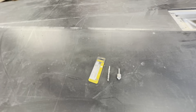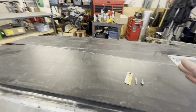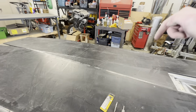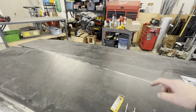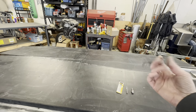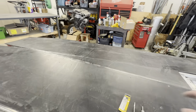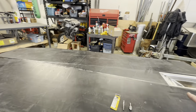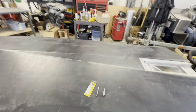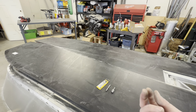Okay, so I've worked on some boats and had to save them. Some guys really don't know what they're doing and they just drill a hole straight through and then just put their bolt through. Then you need two people, one on the other side to twist the nut on and the other guy to hold the bolt down. So thread all of these holes. For one, it helps seal the hole because you got like 200 some odd holes in the boat. The threads help you seal it. And then there's a rubber bonded washer that goes on the other side.